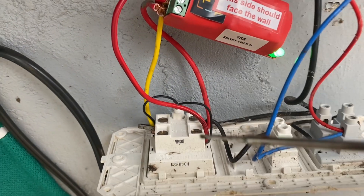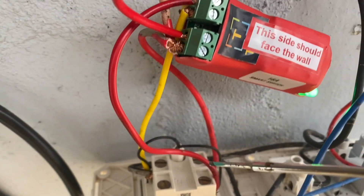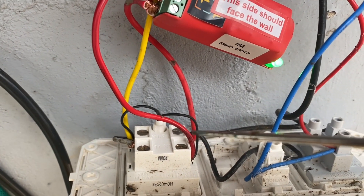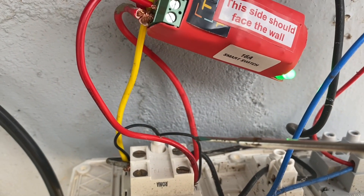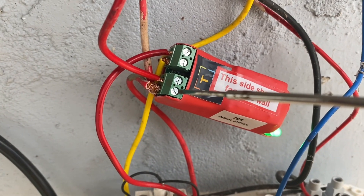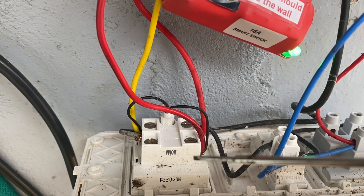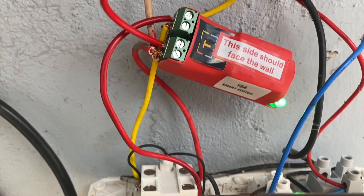The line is coming from the top main power supply. I gave it a cut in between and put it on terminal 4, then sent it to the switch — it's not a socket, it's a switch. So terminal 4 is going into the entry point, which is L2 in the case of an Anchor 32 Ampere switch. So we've got our line and neutral in terminals 2 and 4.